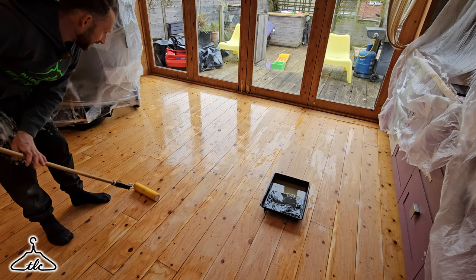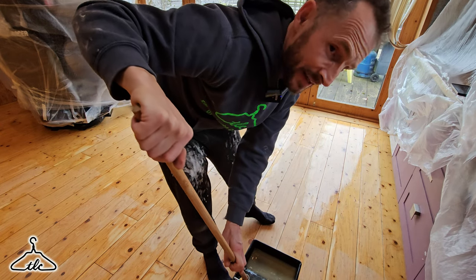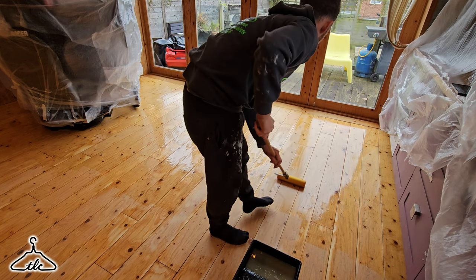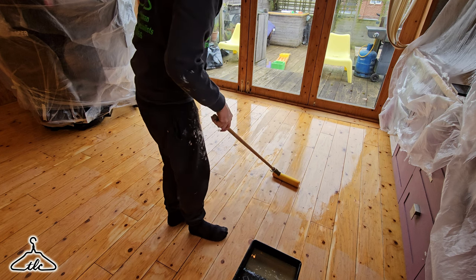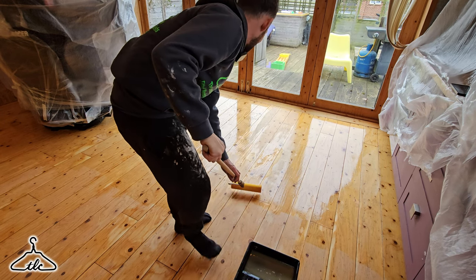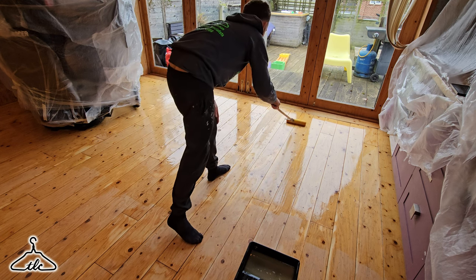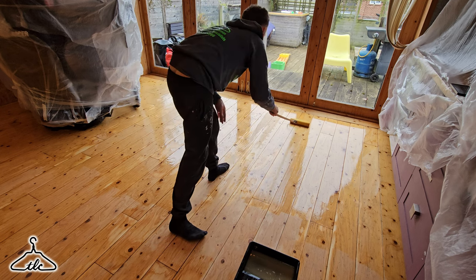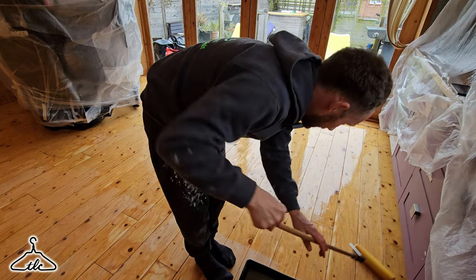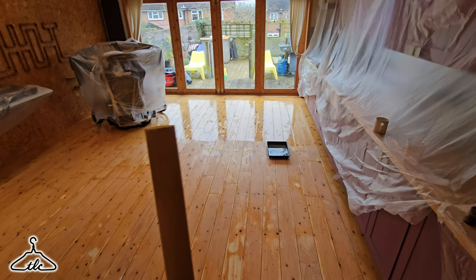After this pot, I want to use the litre. I tried to match the sheen to my last finish — I think I had 30% last time, going by what I had left over in the workshop spray room. I was hoping it's the same finish, mainly because when I peel off the plastic around the skirting, anything I didn't sand and lacquer inside it won't show a sheen difference if it's the same. There was hardly any wear and tear down that end anyway. I'll show you what we've done so far.